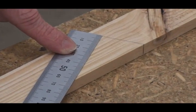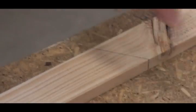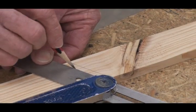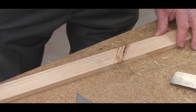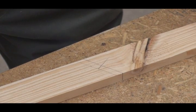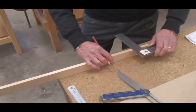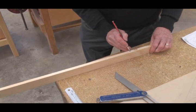The shortening is then marked at the top end of the rafter back from the plumb cut. This measurement allows for half of the ridge thickness. The shortening is marked and the off cut is made apparent. Square the marks across the edges, and we're ready to cut out our rafter.